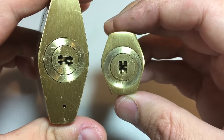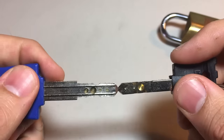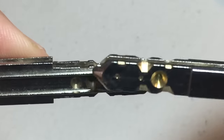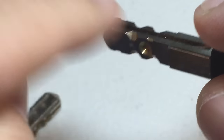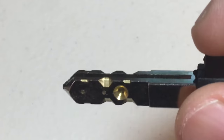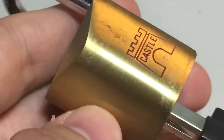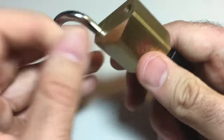First of all, the H keyways are different in how wide open they are. The small padlock has a much more wide open keyway with less restrictive warding compared to the larger one. Let me compare the keys — they both have that dimple section, but the cuts at the top are different. On the big lock's key the cuts come from a vertical direction, whereas on the small lock's key they come at an angle — kind of like angled dimple cuts. You can see those angled dimple pins coming from the corners of the H on the small padlock.